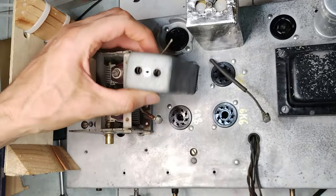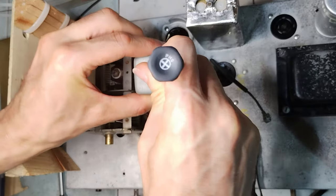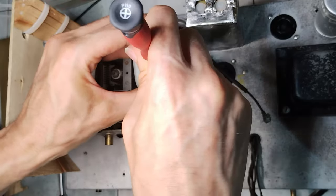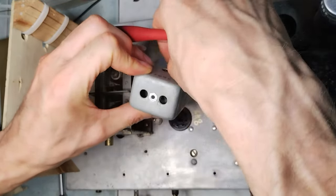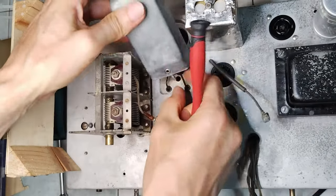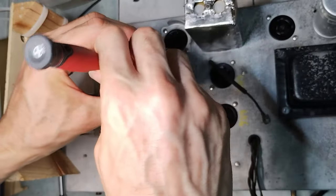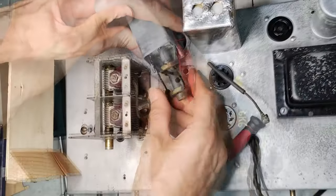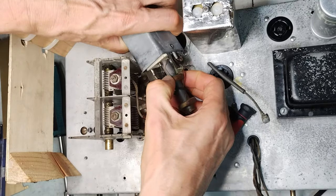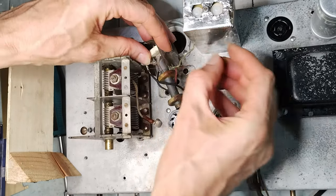Extracting the shield without detaching the wires under the chassis is a job in itself. This clip is kept to document the struggle, considering that there are also other radio models using the same type of IF can. However, trying later to put the shield back with wires as short as in this case turns out to be just impossible. Therefore, later the wires have been replaced and kept about 1 inch longer than strictly needed, hiding the excesses inside the shield.